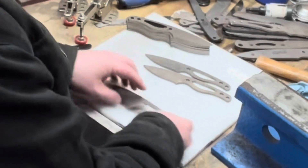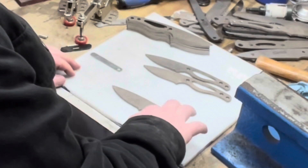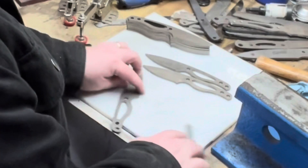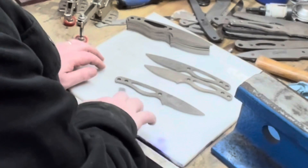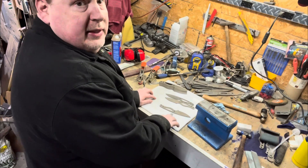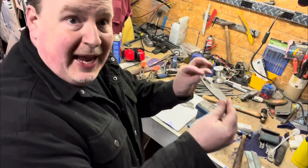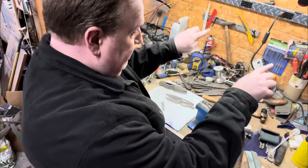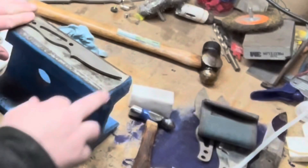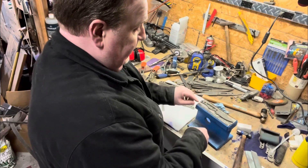Now I'm looking for more warp. Oh, this guy — this one's a basket case. Look at that. Let's turn it upside down, see what we got here. This is actually a harder type of warp to fix. So the warp is down — look at that, zero resistance. This is much greater. It's probably a hundred thousandths if you do it this way. This is an extreme. It's probably thirty thousandths in the middle.